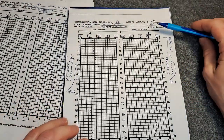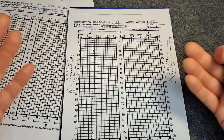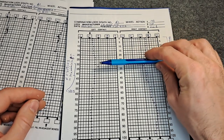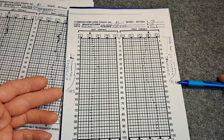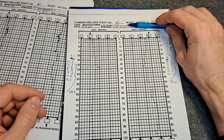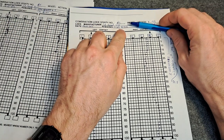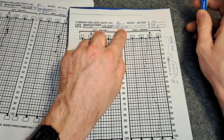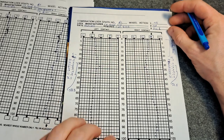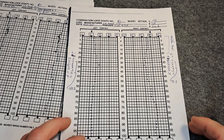And the good thing is I just scanned one wheel, so I don't need to do a high-low test because I know which wheel is indicating: the one that I scanned, and that is wheel 3. So I would suppose wheel 3 is around 32.5, so 33. Now we can assume that wheel 1 is at 17 left and wheel 3 is at 33 left. So all we need to do is find wheel 2. We can exclude already that it is at 53, because otherwise we would have got an open. But that's all I can assume from now.